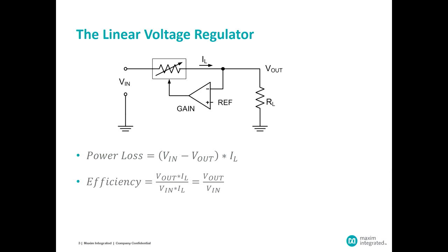We're going to introduce that by going back to a linear voltage regulator, just to understand the idea of voltage regulation that is intended to provide a constant output voltage regardless of variations in either input voltage or the demands for current by the load. The way that's done in a linear regulator is to insert some kind of an impedance that can be controlled so that the amount of impedance will be whatever is necessary to represent the voltage drop between input and output at whatever load current is demanded by the load.